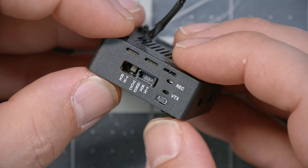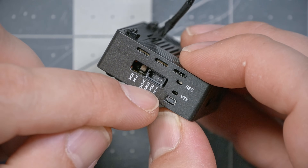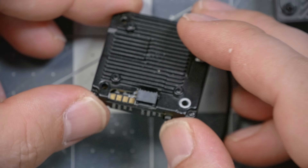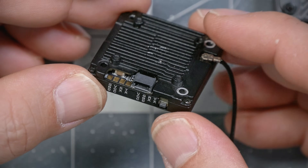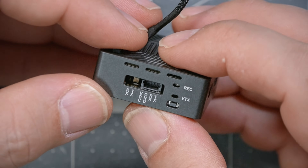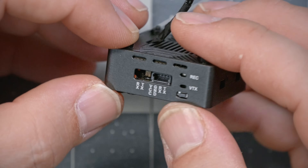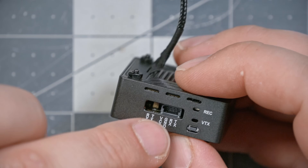In many ways the new video transmitter is similar to what we had before. There's a plug for power and the TX and RX lines that let it talk to the flight controller and do the OSD and other such things. Previous versions of the Caddx video transmitters had both a plug and some easily accessible solder pads for those who like to direct solder. If we look carefully, we can kind of see solder pads for TX and RX inside here, and presumably for power and ground as well, although they're going to be much less accessible than before.